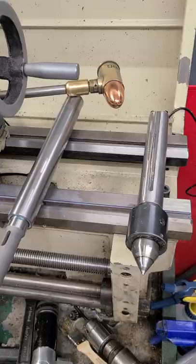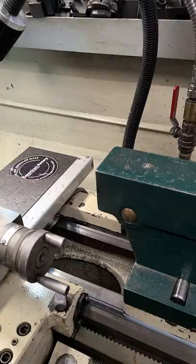Not to mention 1045 — I can heat treat it. So I will, I'm going to do that before going further, because that changes dimensions on stuff. And it's tight, which I already know. This material right now is harder than the old one. I slid that in here and just got through polishing it up.